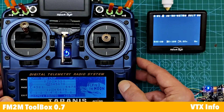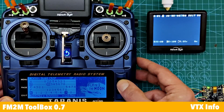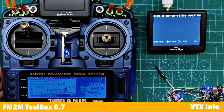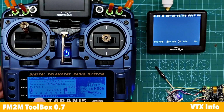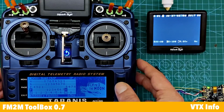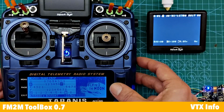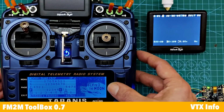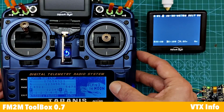So for example, let me see which channel is almost the same. I think it's R7 and yes, F8. Those names were set arbitrarily by manufacturers, so sometimes two different channels are exactly the same frequency. Like with R7 it's 5880 and F8 is 5880, so it's practically the same channel. So you can check how far from your flying buddy you are when selecting another channel and select the one you want.